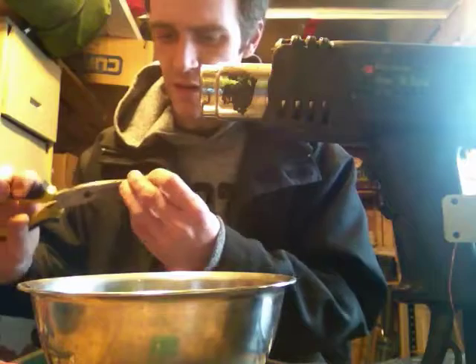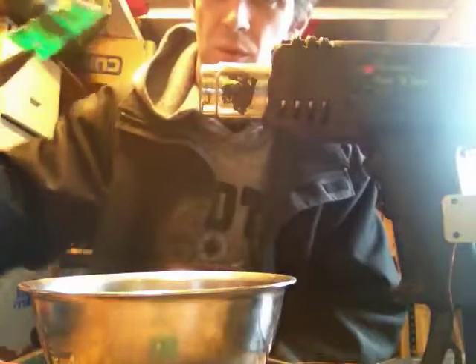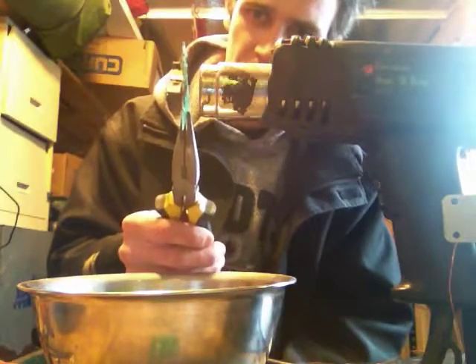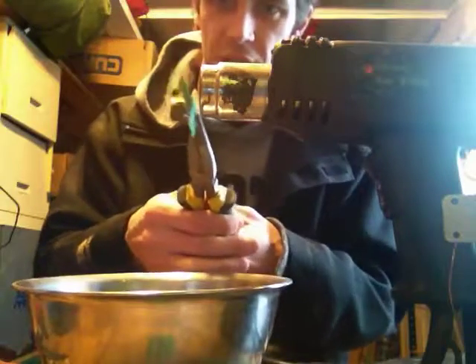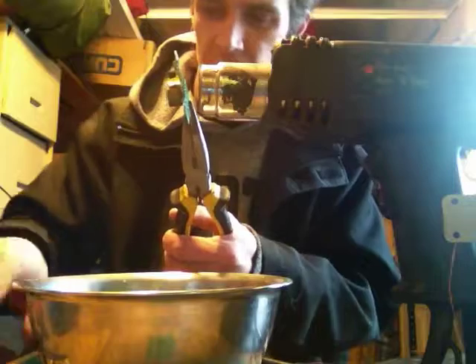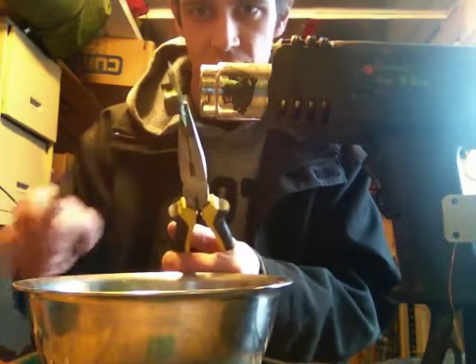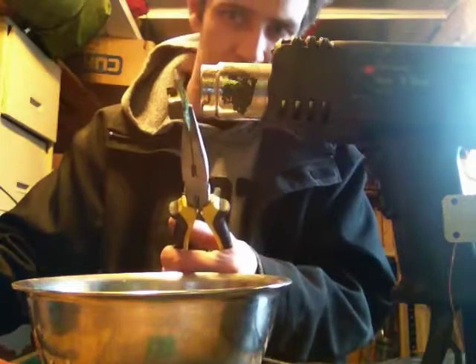Here's one here — just a part of the board. But I have some gold pins on it. Rather than pulling them all out and getting stuff everywhere, I'll just heat it up and pull them out. It makes it nice and clean — your pins are a lot cleaner. Less lead, and it's just a whole lot easier to pull them all out.